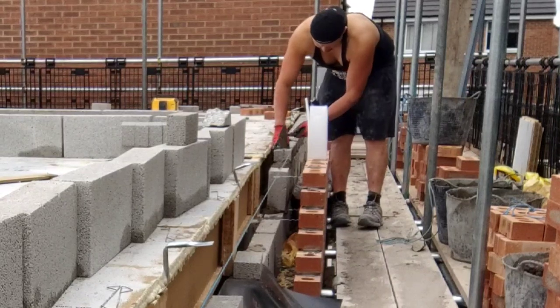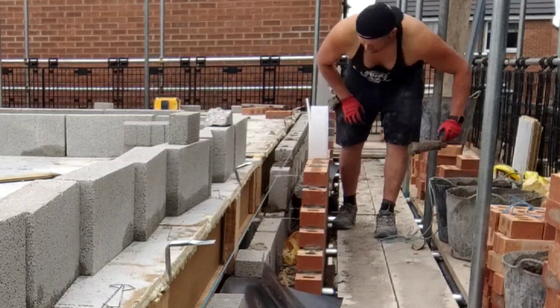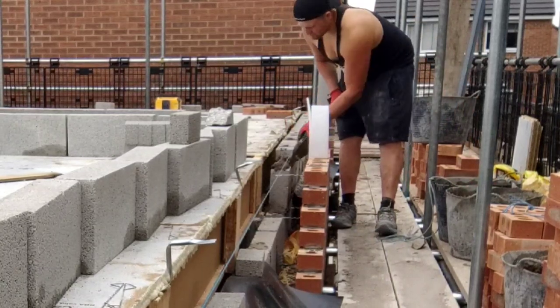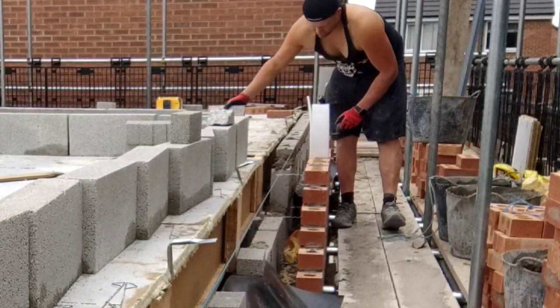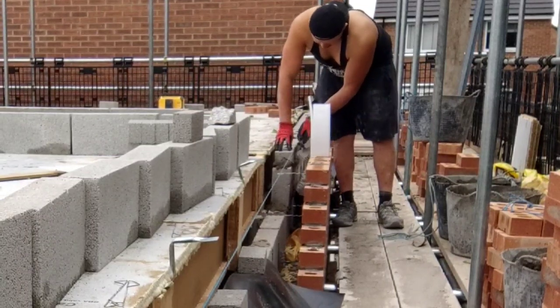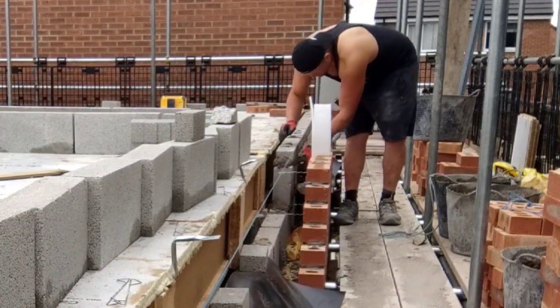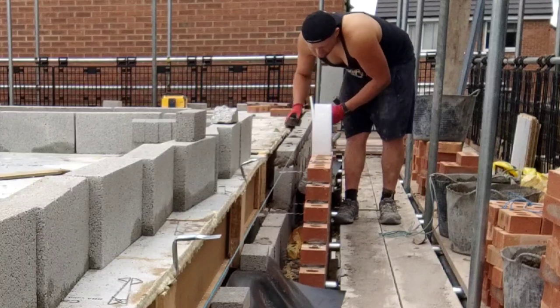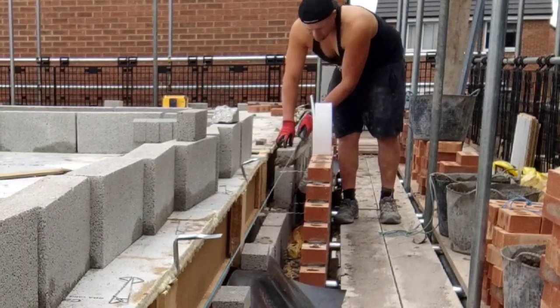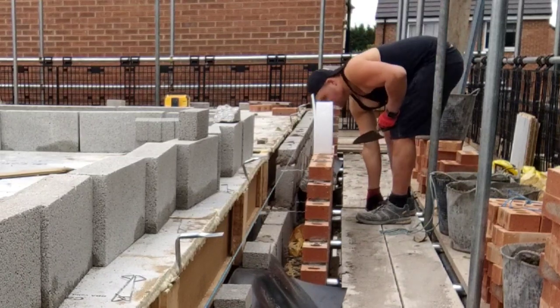You know, stuff ain't gonna fly like it used to be in the boom. You can't be getting pulls anymore. That's why you'll see I've slightly slowed down to just make stuff a little bit neater. Brushing cavities, pointing block work fully all the time, taking that extra time cleaning insulation, this and that. All little things, double checking just to make things what they want.